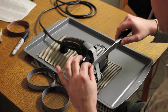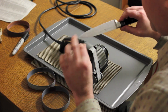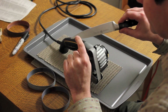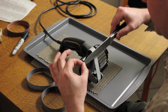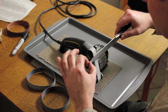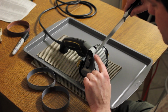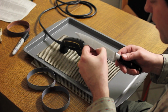One other thing I should mention, I talked about how you lift the handle of the knife as you go through the curve. The other thing is, because the curve brings the edge so far back towards the spine, the edge angle actually gets higher from here to here. So what you really have to do is both do this and do this. Now, this part of it is very slight, and it really only occurs about from here on. It's just a bit of a change. And again, the real key is to make sure that the point of the point is touching when you're done. If it doesn't, then you're never going to get a sharp point.